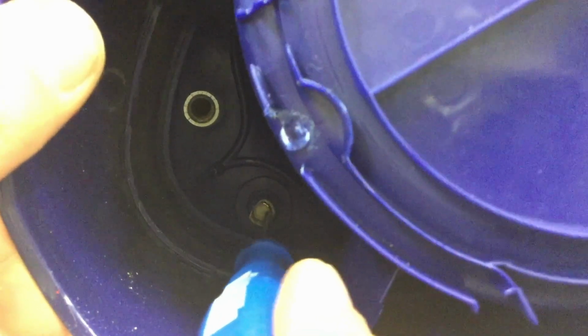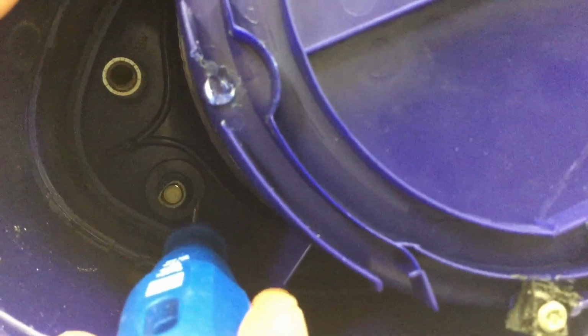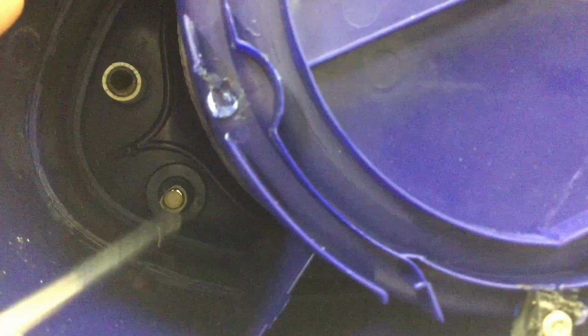Yeah, it's grainy, but as far as the check valve goes, that's as good as it gets. You see, when there's back pressure, the check valve closes. Let's see it from the other side. You see it down there, and if the pressure is gone, then it opens up again. Yeah, you can see it's open. Sorry. This is quite dark in here for the camera, and so if it's open, water is flowing down. Down is towards us into the heating element.